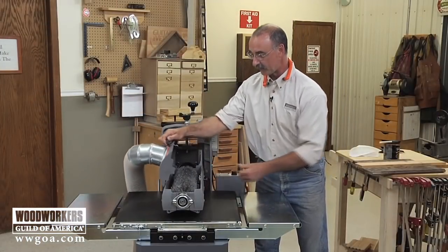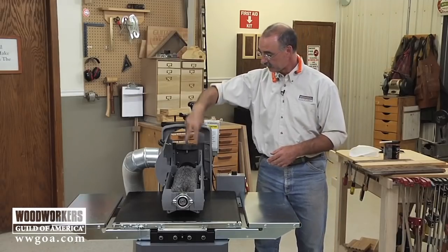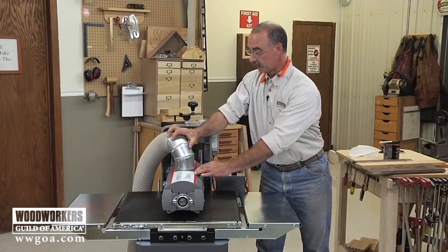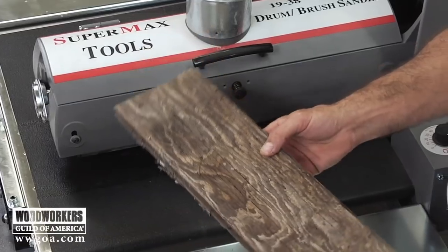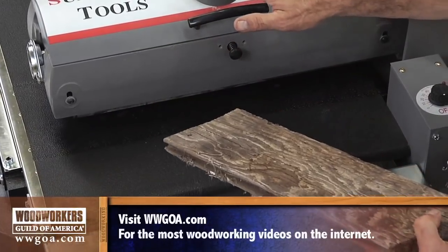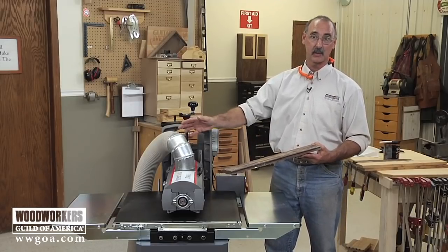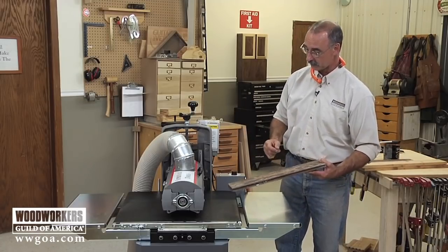I've put a new head on the machine - we've got a wire wheel on here. This adds a whole new dimension, literally three-dimensional, to what we're doing here. Changing the head: there's a bearing on this end, a bearing on that end, a couple of bolts in each one - loosen the bolts, take those out, do the head swap, you're good to go. If you work with barn board, sometimes when it comes into your shop it's just a mess. A lot of times people clean that up with a wire brush - we're effectively doing the same thing here under power. We can send this material through under that wire wheel, get it cleaned up, and send all the debris up into the dust collector helping keep your shop nice and clean.